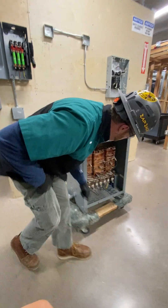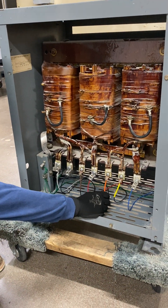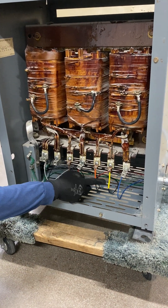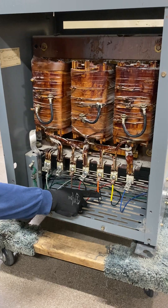So coming around and coming through: H1 is my first primary hot, H2 is my secondary hot for my primary, and H3 is my third — so brown, orange, yellow. In this configuration, B-leg, my H2 orange is going to be my high leg.